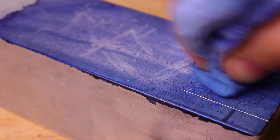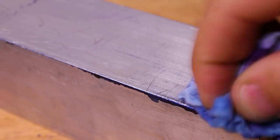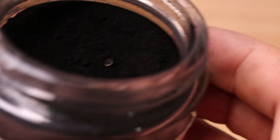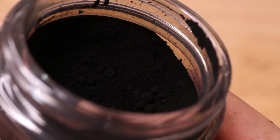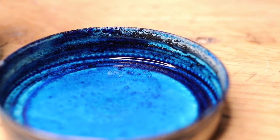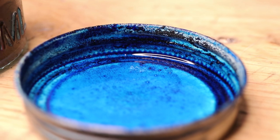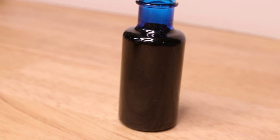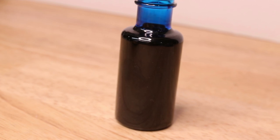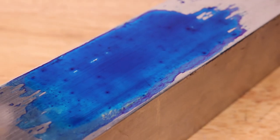The coating can be easily removed using methylated spirits or any other alcohol solvent. Whilst undertaking this I did a few other experiments. I had some spare carbon black pigment from a previous project but it proved to be a poor choice — the pigment is insoluble and made a very grainy coating that just didn't work no matter how much pigment was added. So it is vital to choose a dye that is soluble in the denatured alcohol. I also tried food colouring because it is very affordable and easy to get, however the small amounts of water added increased the drying time to over five minutes, which isn't practical.